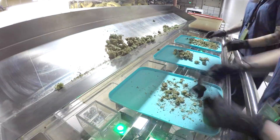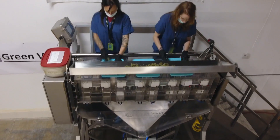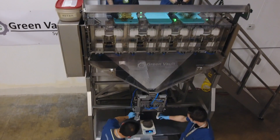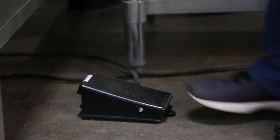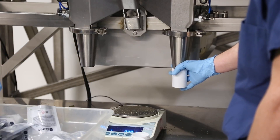When the desired weight is reached, the bins automatically drop into the hopper where they are digitally weighed again to the hundredth of a gram. You have one or two operators call the batch out with a foot pedal, and at that point they can fill any container you choose.